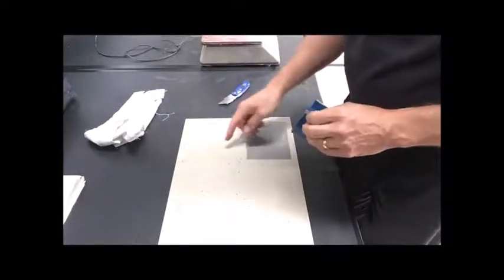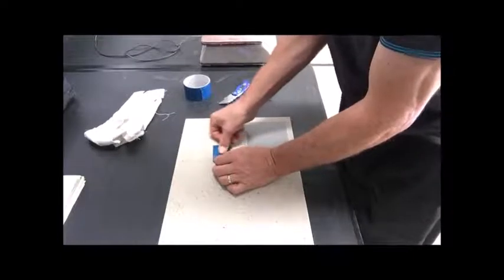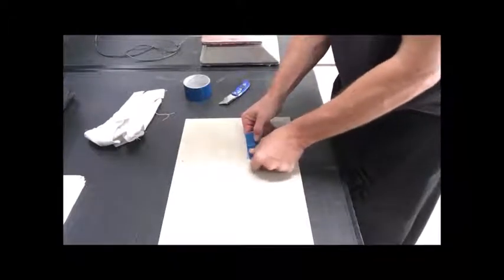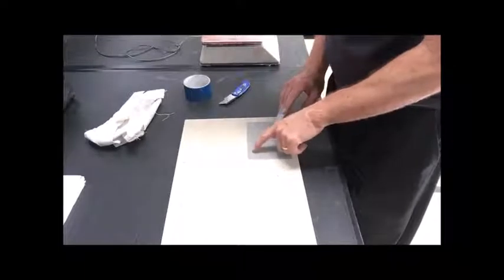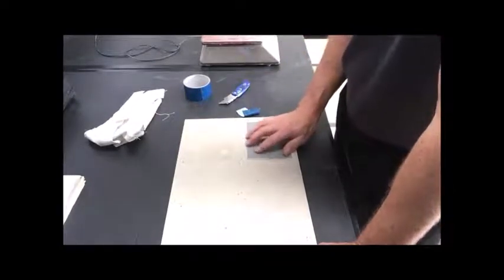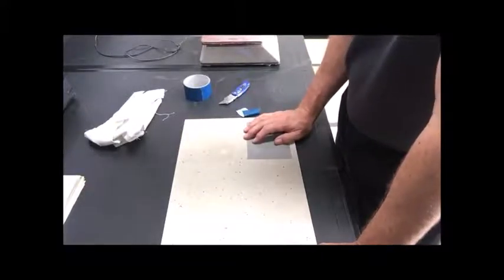Alright, so we've got our scores in there - rough and ready as you can see, but certainly enough to give us an indication. I use cloth tape because the adhesion is much better than basic masking tape. Rub it in well - and you can see there it's pulled off. I don't have a lot of faith in the PU sticking direct to tile. Now let's have a go at the epoxy - and you can also see it's pulling the pieces off the tile. So a quick test, but it gives us a good indication that you can't just clean the tile and put your two coatings on. As always, I'm Resin Jack - take care and keep smiling.